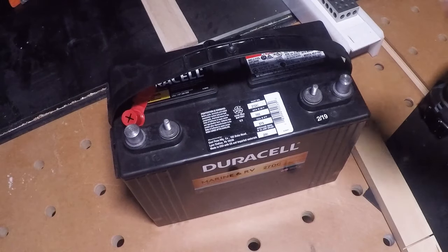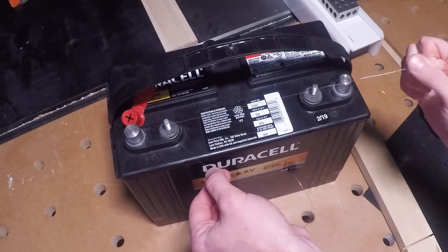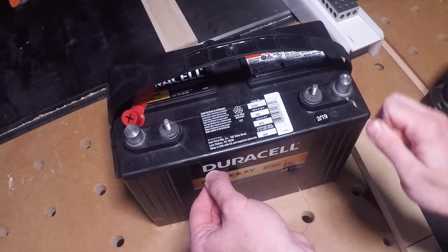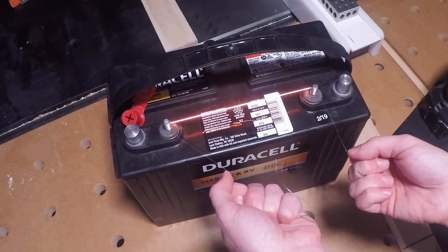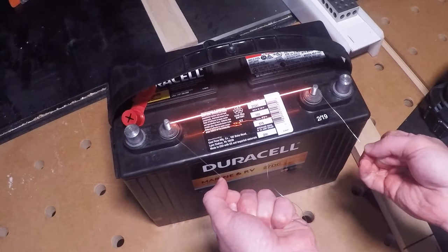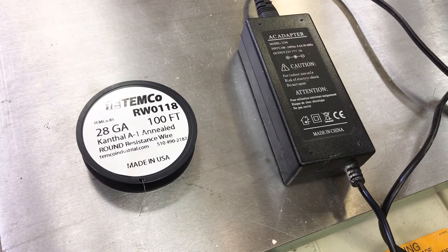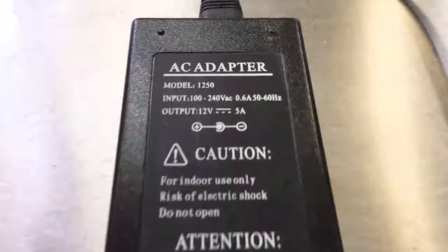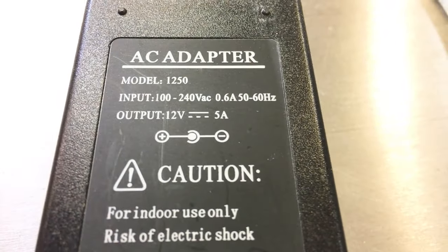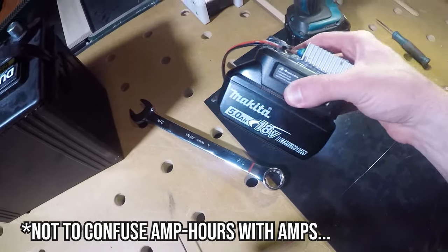To be clear that I'm not being figurative about my wrench analogy — we're making the same circuit. Here's the Kanthal wire. The battery is 12.5 volts right now. That's about three ohms for this 28 gauge Kanthal wire at that length. Very controlled. The primary things you need are 28 gauge Kanthal wire and a 12 volt power supply capable of supplying up to five amps. In my case I'm going to use this Makita battery with a regulator.